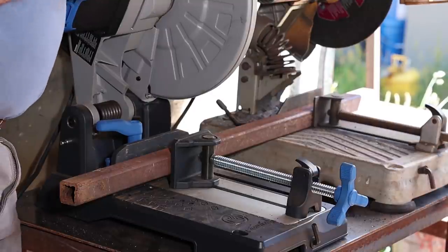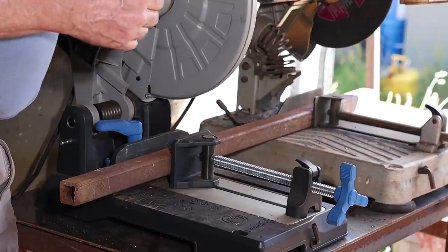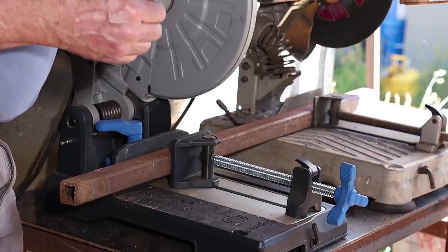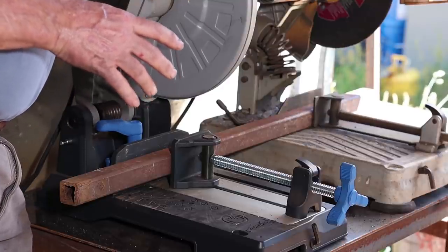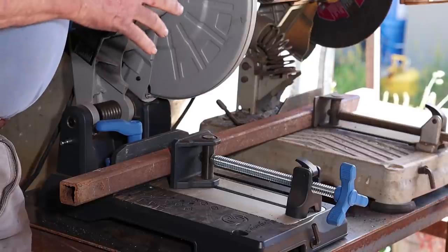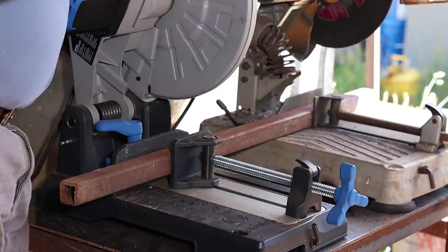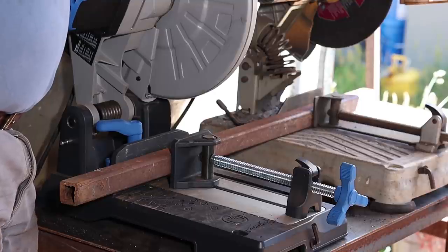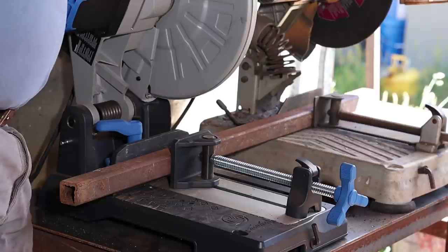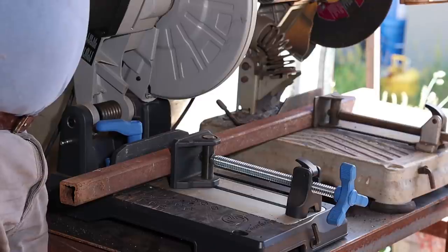Now this table is just a little bit shy of 2 foot by 5 feet long, and it's quarter inch plate for a top and quarter by two angle iron for the rails, some 2 inch square tubing for the legs. It's a pretty heavy table. There is no way I'm going to put this under a drill press. In fact, even if it was a lightweight table, there is no way that it's going to fit under a drill press, although I suppose I could have drilled the top before putting it on if it was lighter. But the top probably weighs about 75 pounds, so one way or the other, that's not the way I was going to do this. Could certainly drill it with a hand drill.